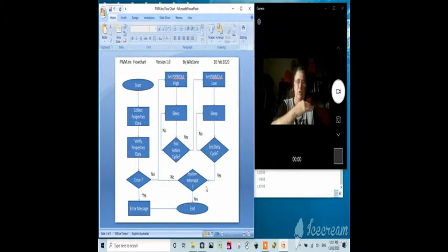Chip's gone to sleep. Now we've got this thing here, a system interrupt. So what we are saying to our programmer is, look, until such time as that system finishes, or until something else happens, maybe some other external influence has come in and said, we need to interrupt your process. Right, no worries. We're going to keep doing that until we get a system interrupt. That's fine. We'll run this routine. It's going to go around in a loop, and the way we break that loop is with a system interrupt. And they can be programmed in fairly simply.